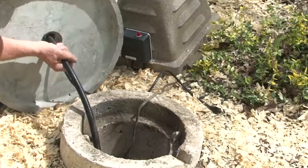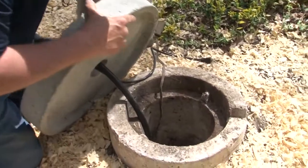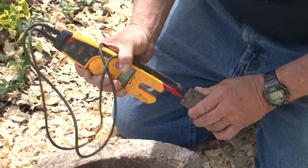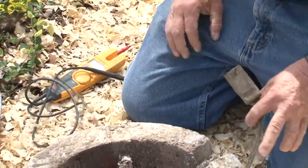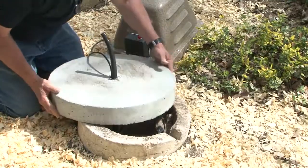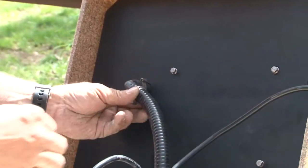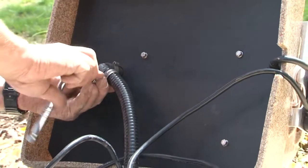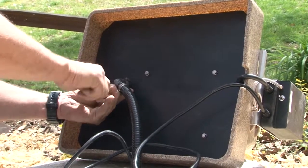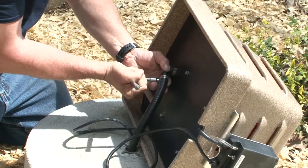I'm going to take this end and shove it through the hole from the bottom. We've got our float hanging down there where we want it. I'm going to check what kind of power I have here — same amount as in the home. So I'm going to go ahead and put this hose on here. It's a pretty tight fit but that's good. I'm going to tighten up this clamp. It's good to use a ratchet and the thin clamp that comes with it, because it's a really good hose made for underground use, and we want a good tight clamp on it.